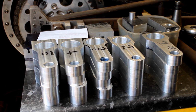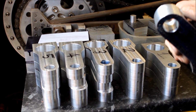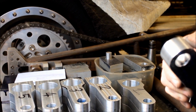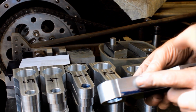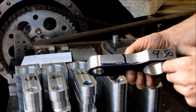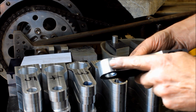Well, we've radiused the ends, as we can see. The only snag is, on one of them it left a little saw mark where we'd cut them, so I've taken them all to the same. Unfortunately, it's left about a millimetre step. You can see there. So what we'll do is reset them back up in the horizontal mill, and redo the faces and polish them in.